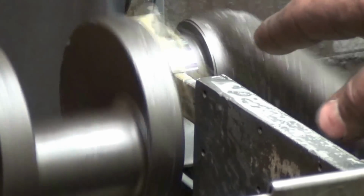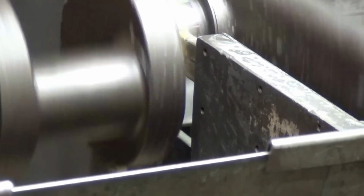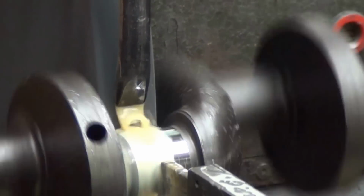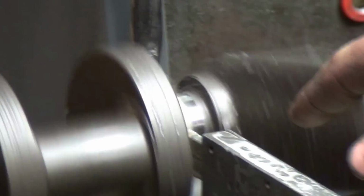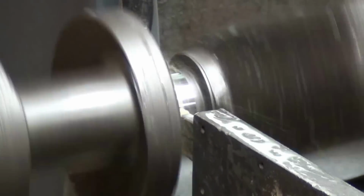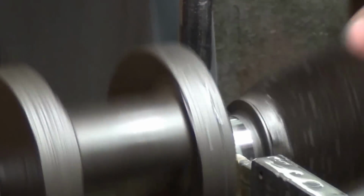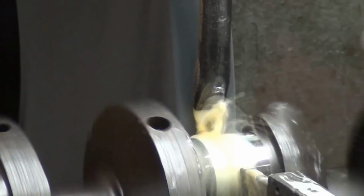There's a little bit of a shadow there, if you can zoom in on it, it's like half of it. This journal cleans up as well as all the rest of them will be, we'll probably get this to 10 under.